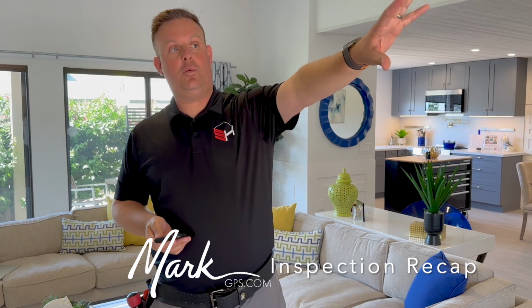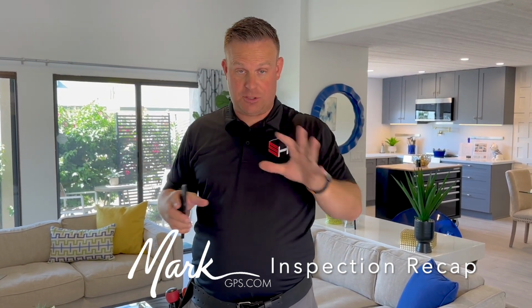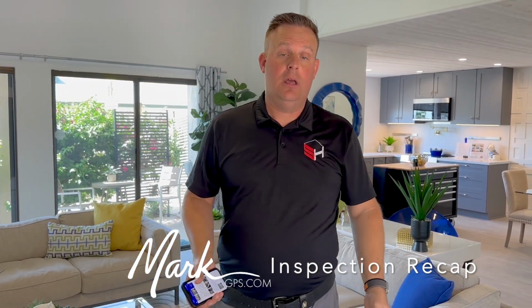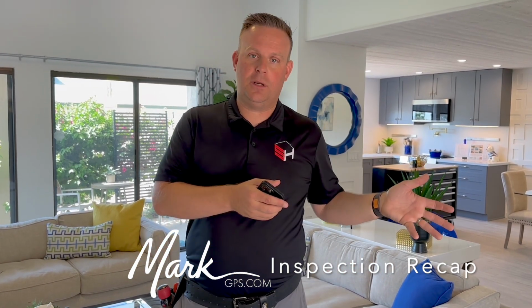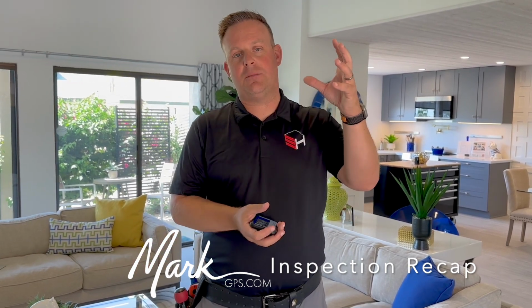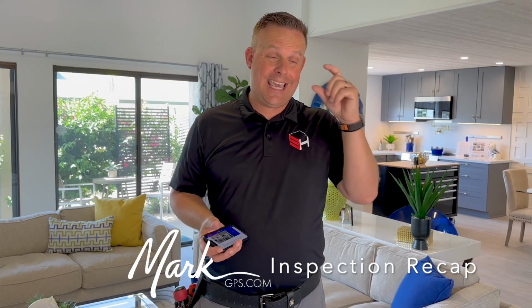And then the two windows in the primary, single hung windows that slide vertically, have sash cartridges or counterbalances, as some people call them. They're both broken, all four of them, so the window will not stay open. They're heavy aluminum windows. If you let it go, the window will crash down. It's a pretty simple fix. It's a handyman deal, or I always say, hey, get on YouTube, cuss out one of the windows, and then you'll figure it out and be able to fix the other. But it's very common. Everything in the window is made out of aluminum or metal, except the retaining clips. They make them out of plastic. Go figure, over time they become brittle, break, and then you're stuck with two windows that don't want to open.